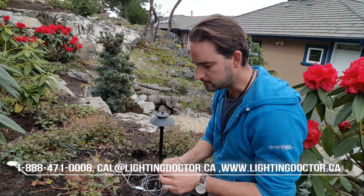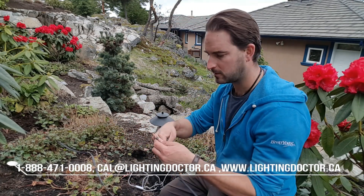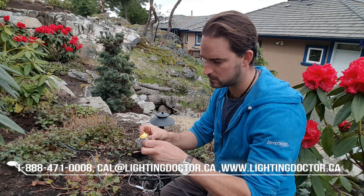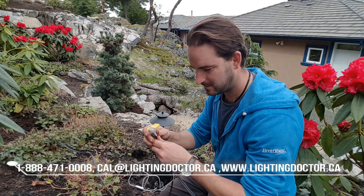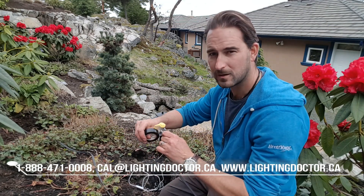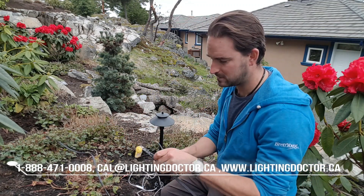It's really simple — we've got our wire coming in, our wire going out, and then we've got two wires from our fixture. We're going to take one of those and just stick them in the ports at the bottom of our snap lock connectors. There's three holes, three wires — pretty simple. Put them in, snap it tight, and then put a little extra electrical tape along the base just to keep that nice and tight. You don't have to go around the whole thing because these are waterproof.